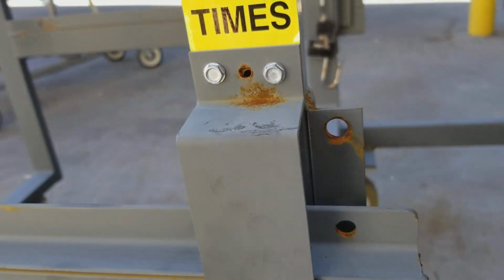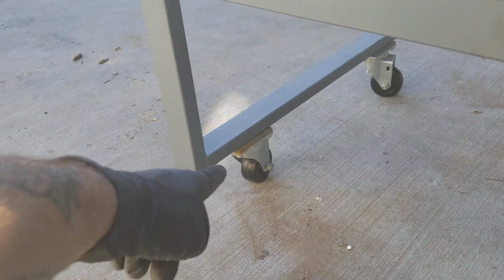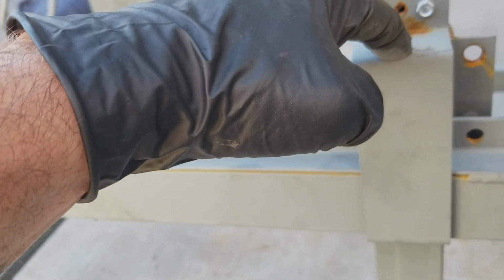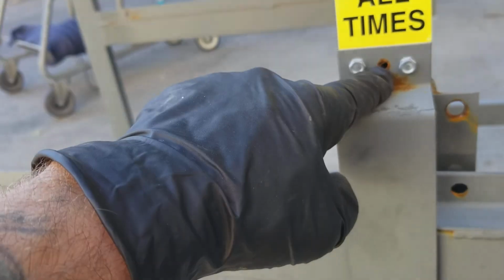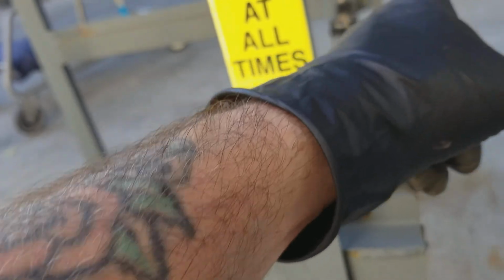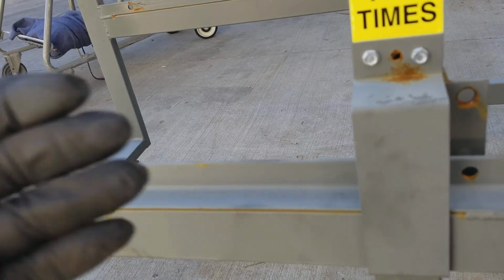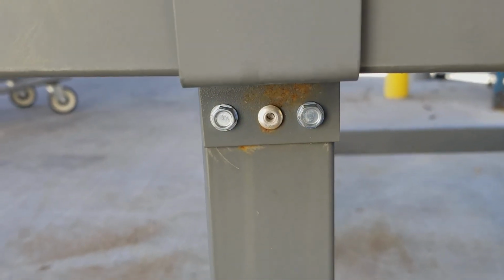So with that design flaw up top causing a push down on the ladder when there are 4-inch ladder wheels on there like they're supposed to be, this rail here pushes down on this bracket that's supposed to hold the rail in place, and it busted out the rivet on the top on this side and the rivet on the bottom on the other side. So what I had to do is push everything in. I put 2 self-tappers in the top, 2 self-tappers in the bottom.